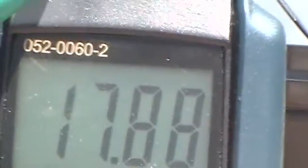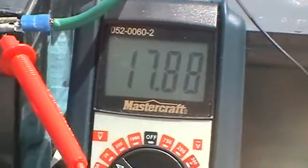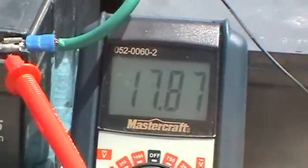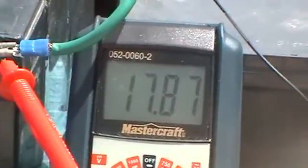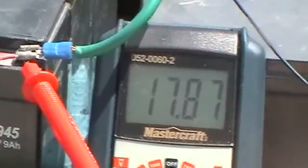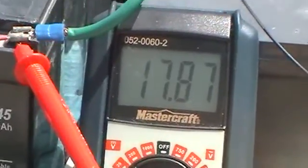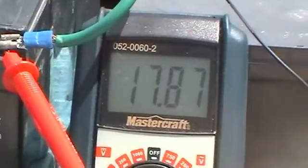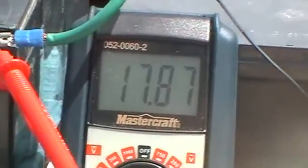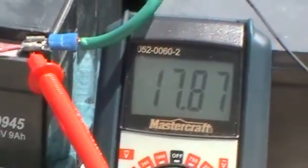And I think that basically proves my point — 50-watt bulb, 12-volt system. When it gets more than three-quarters of a meter per second, it goes up around a meter per second and maintains in this area. Around three-quarters of a meter per second it maintains in this area. Right now it's less than half a meter per second — there, we're going up a little bit. It should be starting to get some increased rotation here fairly shortly.